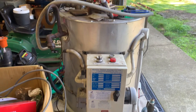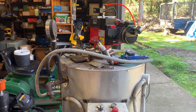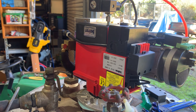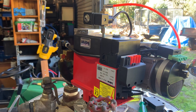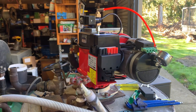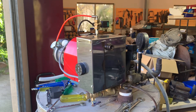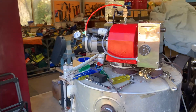Almost a kind of a flash boiler. I had a gas burner on it when I got it, pulled that off, and have since modified a Bayran STW 120P — which is the model with the built-in air pump — for vertical firing. Currently you can only mount these in a horizontal fashion due to the oil tank, so what we've done is spun the oil tank around so that it is facing upwards when the burner is facing downwards.